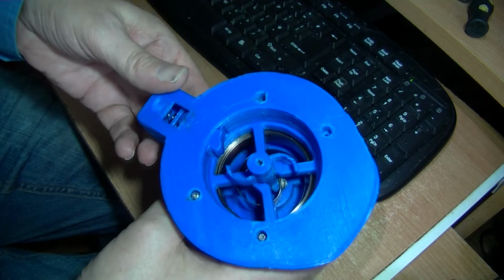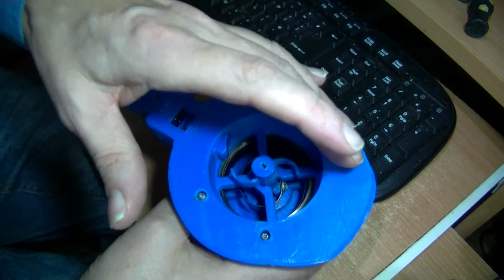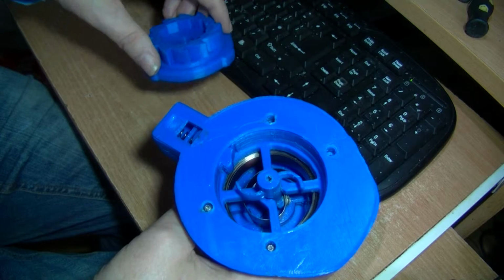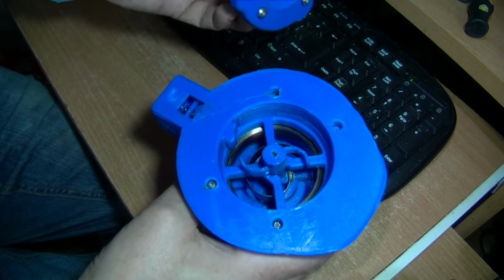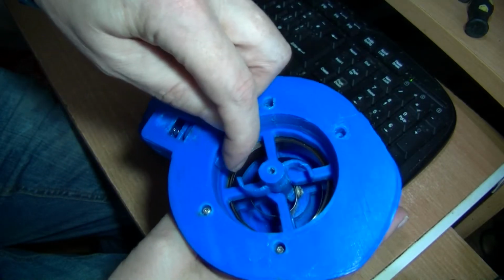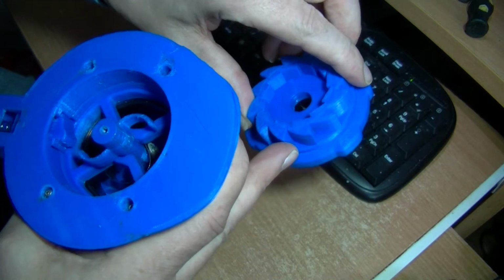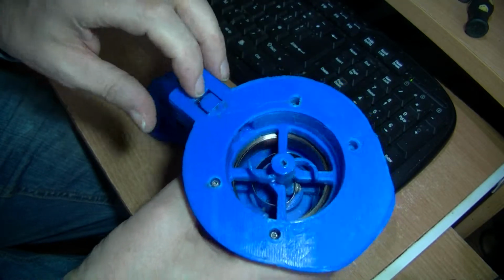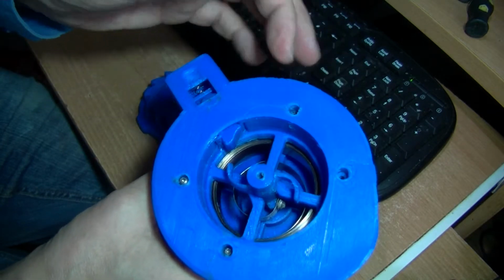Because what I found is when it starts spinning there's so much power, so much kinetic energy in a way in it, potential energy, whatever. Don't pick me up on my physics, wasn't that good, but okay. That the teeth would bang against this Pawl and either break the Pawl off or break the teeth on the ratchet off. So now when you pull it back it latches out the way until you're ready to re-trigger it, so to speak.